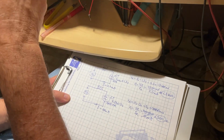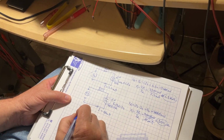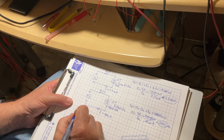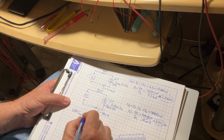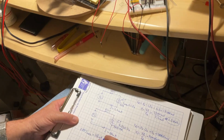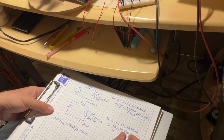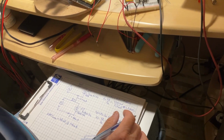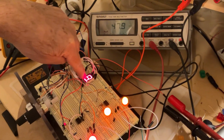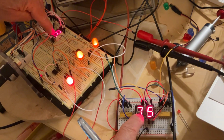All the LEDs are connected right now in parallel. So if I want to find the current for only one LED, it is going to be 48 milliamps consumed right now divided by 8, which is 6 milliamps. And my goal is to pair the brightness of this one to the brightness of the digits we're going to make our project next time.